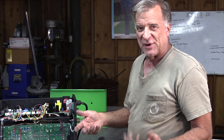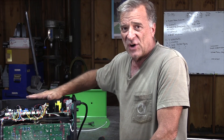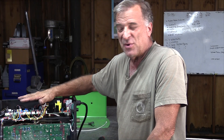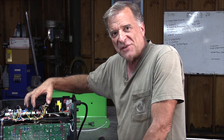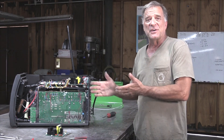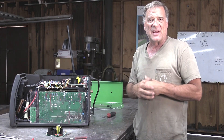Let me put it all together and try it — that'll definitely say yes it was or no it wasn't. But the amount of dust inside this machine when I took the cover off was horrible. You've got to be good about cleaning these machines out, or the dust lies on all of the electrical components and acts like an insulator. It keeps the heat in the electrical components themselves instead of the fans being able to blow the heat away, and that'll burn things up too. So if you're curious how this all turns out, go ahead and leave a comment down below and I'll send you a message to let you know whether it actually worked.